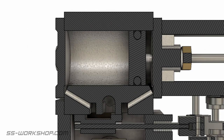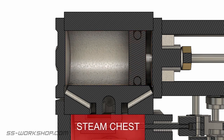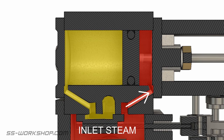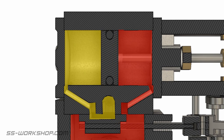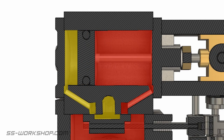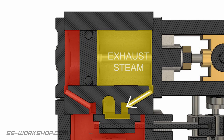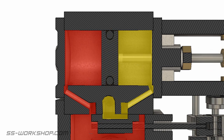This is a section cut through one of the cylinders so we can quite clearly see all the parts. The steam chest is at the bottom of the screen and a slide valve fits within that. The high pressure steam from the boiler is fed into the steam chest, shown in red on the diagram. As the valve moves, steam is led into the cylinder pushing the piston forward. The exhaust steam is then released through the opposite passages shown in yellow on this diagram. This reverses on the return stroke.